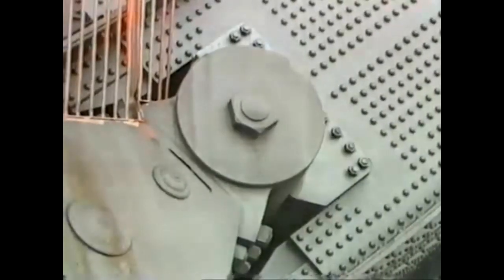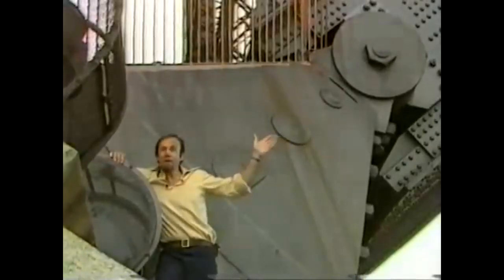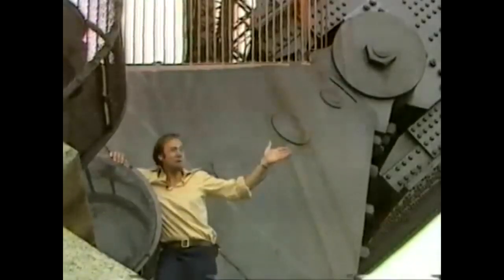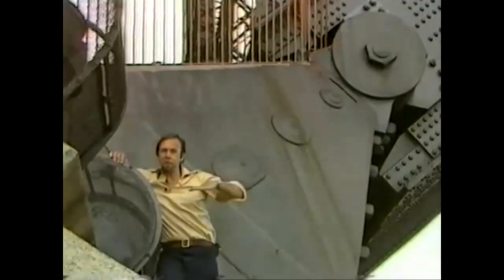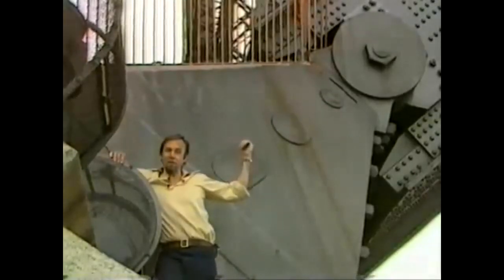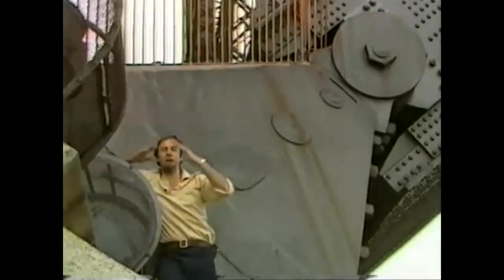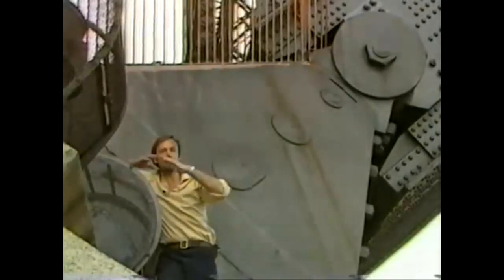So that's the function of the bearings: they allow a certain amount of movement as the bridge gets longer and shorter with heating and cooling. The top of the bridge can go up and down a distance of about 18 centimetres — quite a bit of movement in a big bridge. The bearings allow the whole thing to flex; like my elbows, they allow the movement to happen.